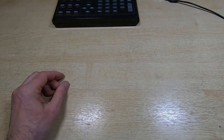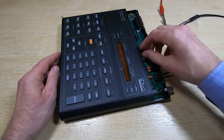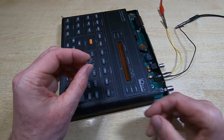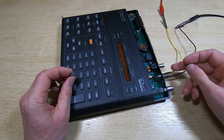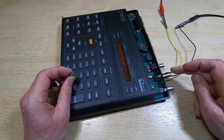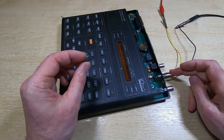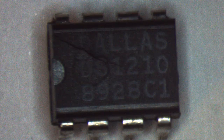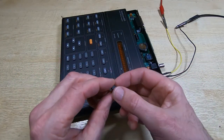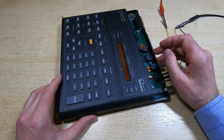To fix it you could just drop in a new DS-1210, but this one is actually cracked. I think what happened is that at some point because of the unusual power connector, power was connected incorrectly or over-voltage was applied - it's expecting 5 volts, which is fairly unusual, so possibly someone fed 12 volts or something like that. That would destroy this device. There's a big crack all the way across it - you can see this under the microscope. I do have some of these spare, but because the chip select input isn't being used, we can make our own.